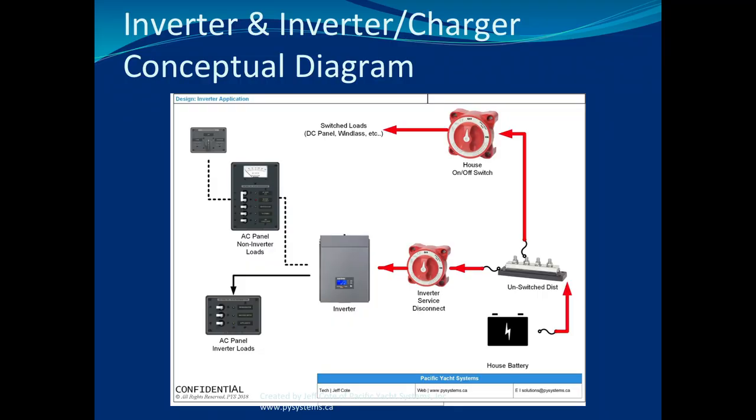So for example, it often happens that people will turn their boat over and suddenly lose shore power, and they had a bunch of heaters connected. They lose shore power, they had about 40 amps, maybe 3,000, 4,000, 5,000 watts of electrical heating on board. Their inverter was enabled, but on standby. The inverter goes, oh my God, we lost shore power, let me try to meet demand. The inverter switches internally suddenly from bypass to invert, and it tries to run 5,000 watts of load, and this fuse blows.